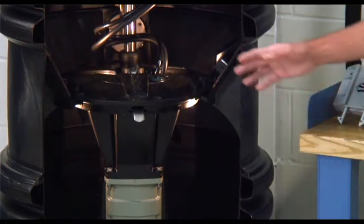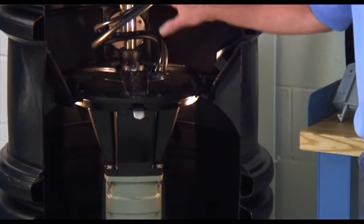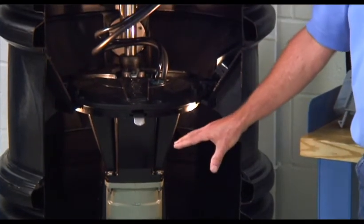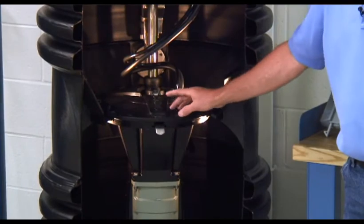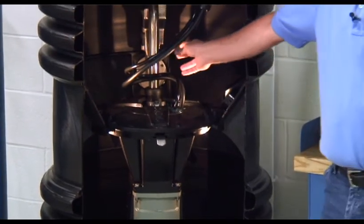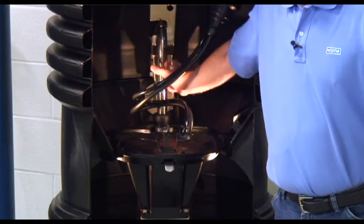The dry well version is supported in the station by a top housing which rests on a deck or transition between the dry well portion and the wet well portion of the tank. It's secured by a latching mechanism and the liquids are discharged through a stainless steel discharge tube that attaches to a ball valve assembly within the station.